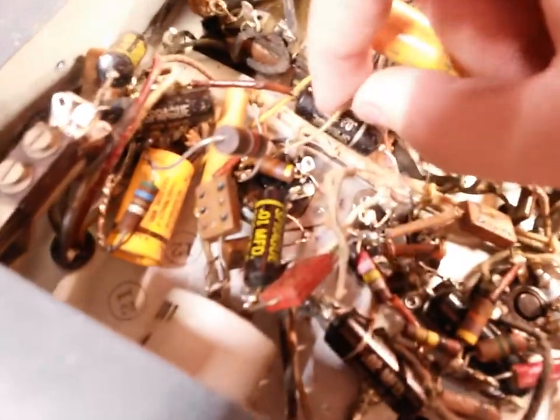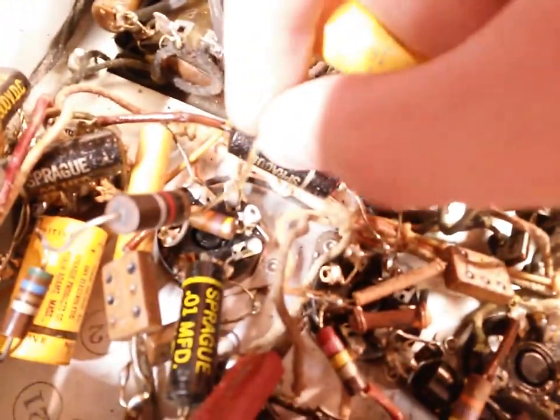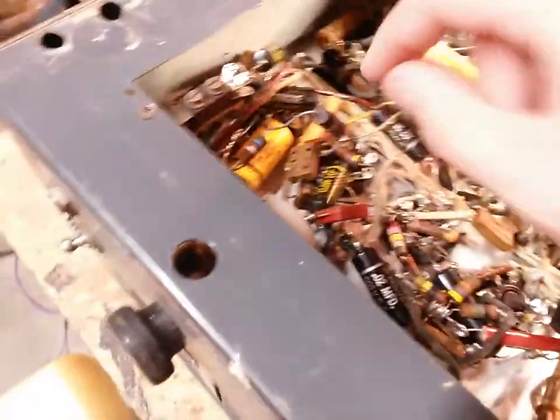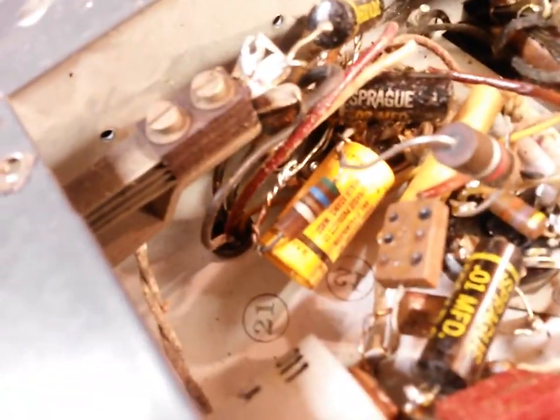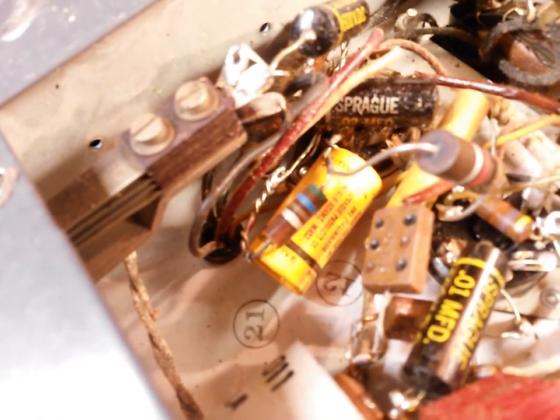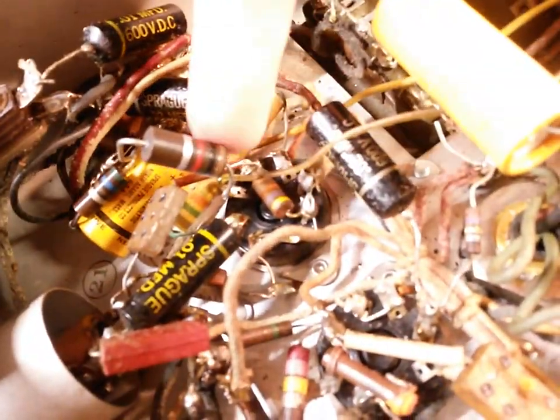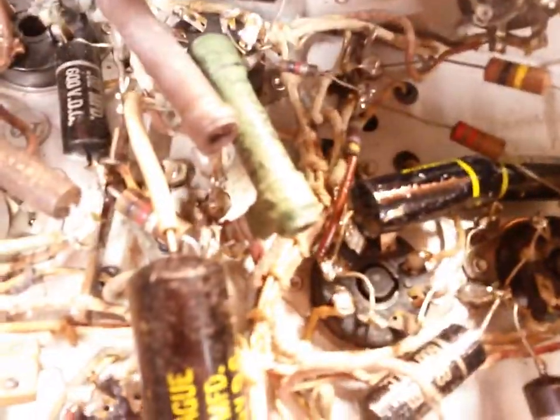That, and then there's what looks like very thin speaker wire, which is rated for no more than 50 volts. There's this absolute beauty of a job. Can you see that there? Oh yeah, and just tack solder it on there, it doesn't really matter. And this here, look at that solder on that tube pin there, beautiful, isn't it? And then we have this here. They forgot the solder, the resistor.